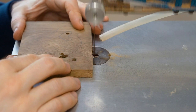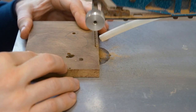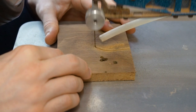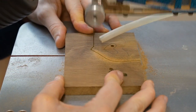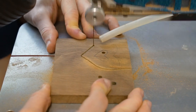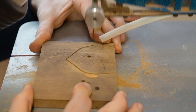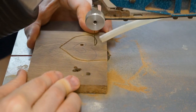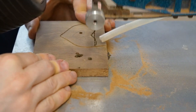The spiral blade has both advantages and disadvantages when compared with our regular blade and reverse tooth blades. When it comes to the finish, I find that you get a finer finish after you finish cutting on the reverse tooth blade and on the regular blades. The spiral blade requires more hand sanding and more finishing after you've finished the cutting. The speed that you can feed the item through the saw itself is slower.